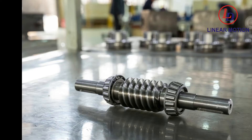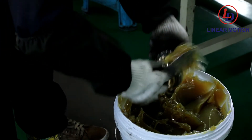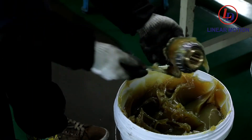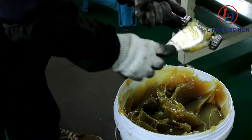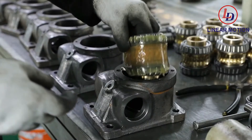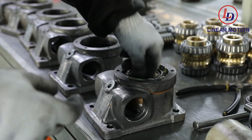There is no standard driving length, as all worm screw jack systems are built to specification. The jack housings are made of ductile iron and are proportioned to support the rated capacity of the unit. The quarter-ton and half-ton models are made with aluminum housings.